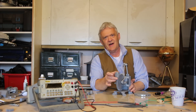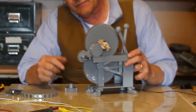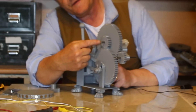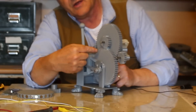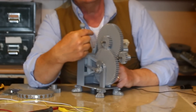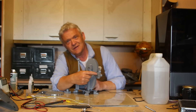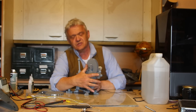In order to do that, we put that gear there, and we need some way of holding it. In the Tinkercad file you'll find this bit. You print that off and it goes right there. What I've done is created a gear chain with the large cog interfacing with a small cog. On the same shaft is another large cog interfacing with this small cog. So we get 3 to 1 and again 3 to 1, giving us 9 to 1 overall because the gears multiply as you add them. So for every one turn of this we get nine turns of this — and we could keep going, but that looks like enough.